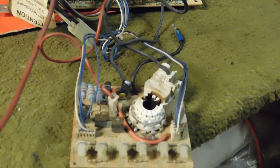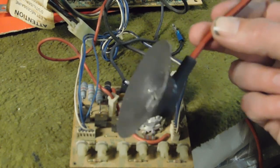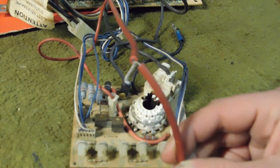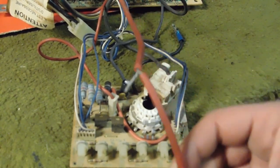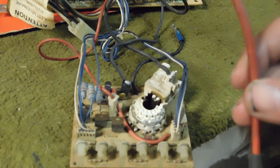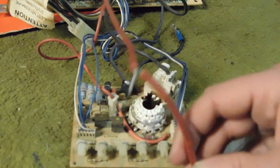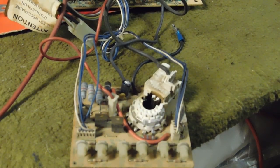One of the next things we'll do is how to replace a flyback, because take a look at this — somebody decided to splice one of these little cup sockets for the high voltage anode. They just twisted the wire together, bent it, and electrical taped it. When you're talking about high voltage like tens of thousands of volts — 10, 20, possibly 30,000 volts — that is not something you should be doing. It doesn't surprise me that the monitor failed within a couple of weeks.